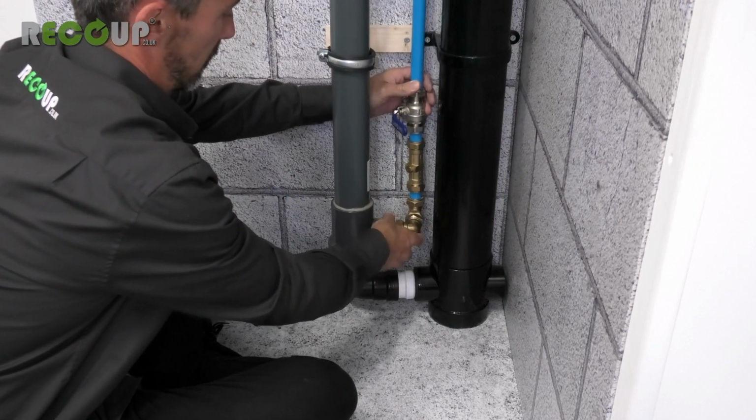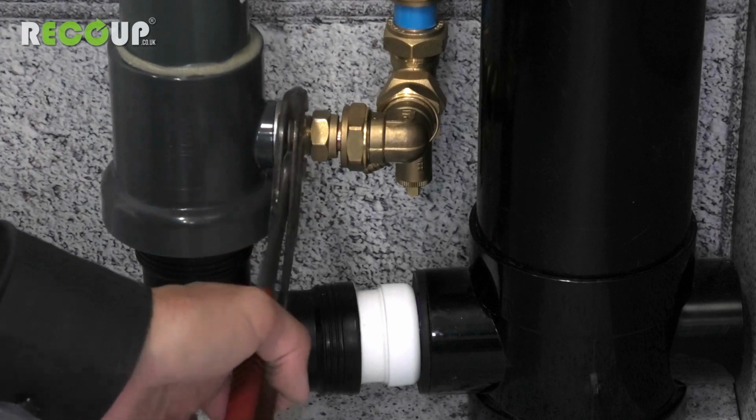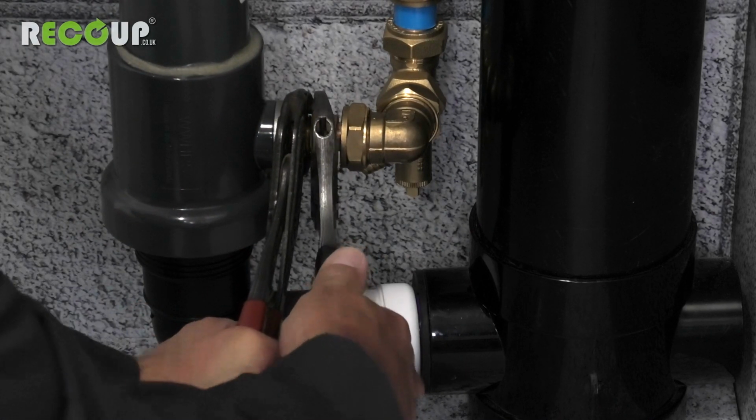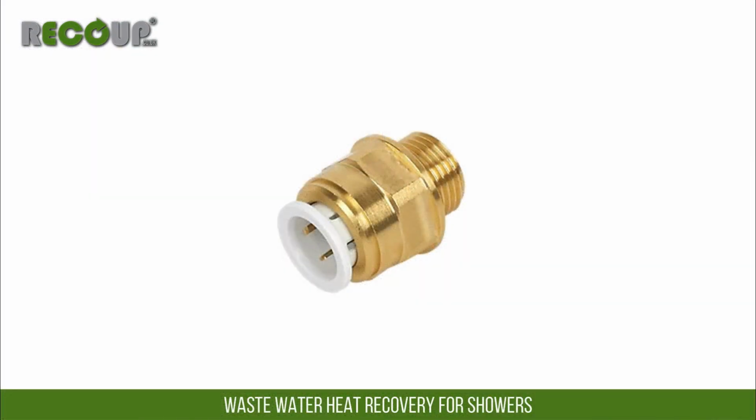When connecting pipework to the half-inch male adapters, ensure the adapters are held firmly whilst tightening the pipework to them. Forces exceeding 30 Nm could be applied through the adapter if they are not held in place. Using push-fit half-inch male BSP connectors can help prevent over-tightening of the threaded connector when connecting pipework.